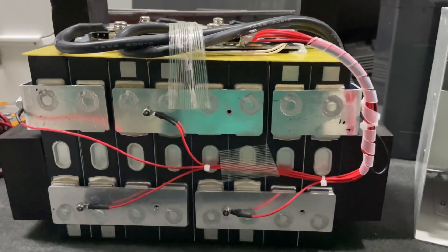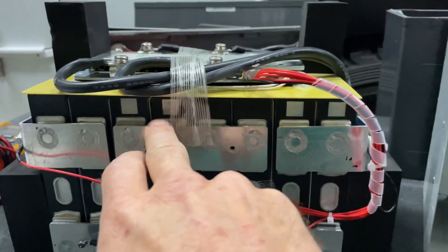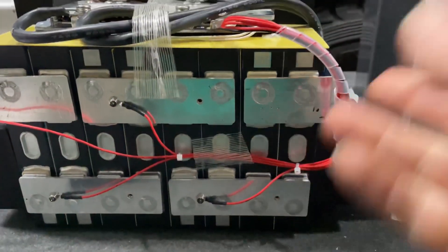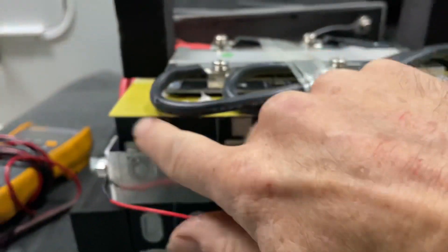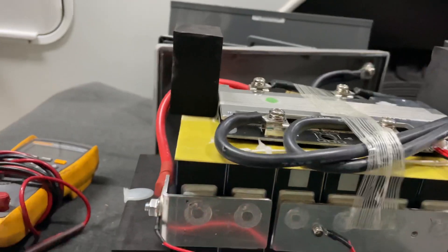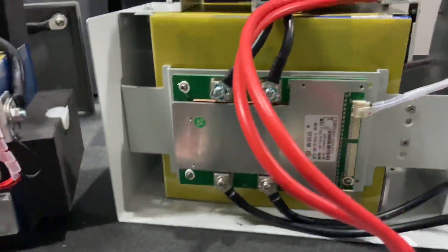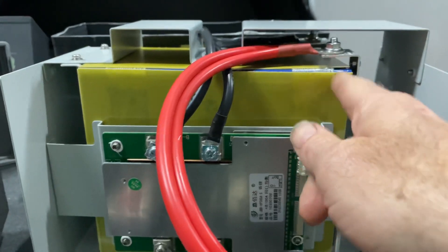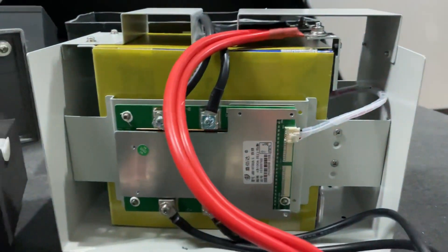This is completely different from the previous basic model. It's using cells in pairs — two pairs here, two pairs here, two pairs here, two pairs here. I'm guessing they're 50 amp hour cells or something like that; there's no information and I've pulled stickers off. The basic cells measure 130mm long, 147mm high, and 25mm thick, versus the plus cells which are 200mm long, 175mm high, and 25mm thick. There are only four cells in the plus one.